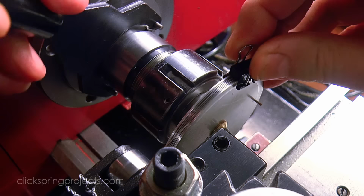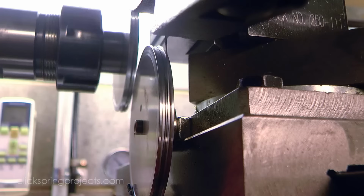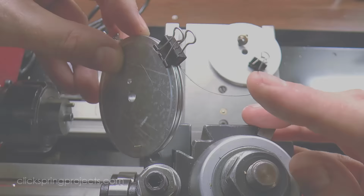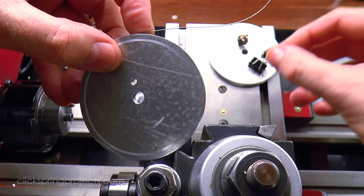From here, the wire is fed from spool to spool, while gradually reducing the gap between the rollers on the way to final dimension. Now, depending on the amount of rolling to be done, the wire may take on more of a work-hardened state than is reasonable to accept in terms of the damage risk to the rollers, in which case the wire is simply annealed again as before.